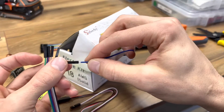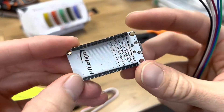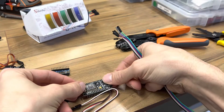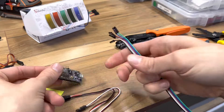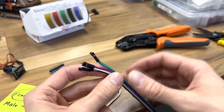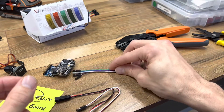Why do we recommend the female to always go on the wire? Here's why: your board is the element you have control of — you can fasten it down to a piece of plastic or foam. The wires are the part that sling around. If you have male ends on your wires, you are just waiting for an opportunity to accidentally fry your components.